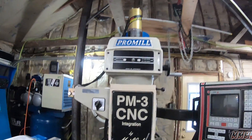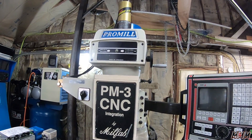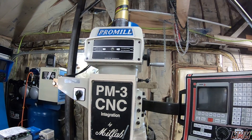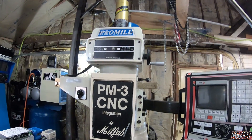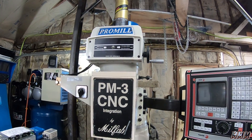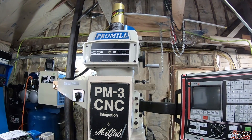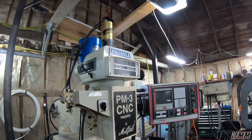RPM, as is, it's at 4,200 RPM. But we're running a VFD on here, and when you run a VFD you can overclock them, so this will be a 5,000 RPM machine. The Tormach is a 7,500 RPM machine. But with more rigidity and more horsepower, despite the slower RPM speed, we'll still be able to make deeper, faster cuts.